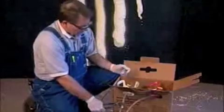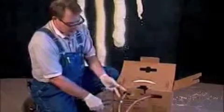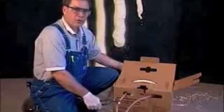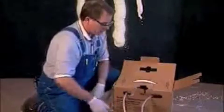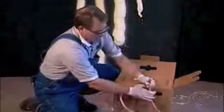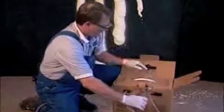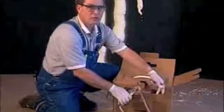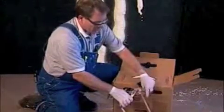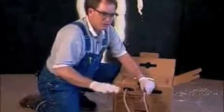Then remove the hose, and very carefully after you remove the hose, take the end of the hose and point it away from you and then release the pressure on the channel locks, and the chemicals then will flow away from you. And perform the same procedure then on the next hose by kinking them, locking them off with a pair of channel locks or pliers, removing the hose, pointing the free end of the hose away from your body, away from anyone else, and then releasing the pressure, allowing the chemicals to flow somewhere else. Gather up your hose and dispose of it according to your company requirements.